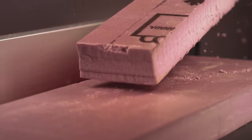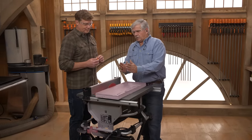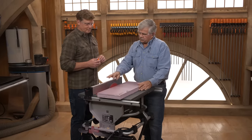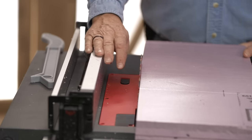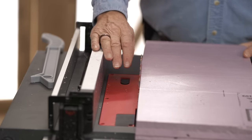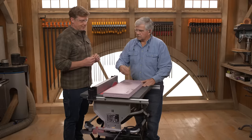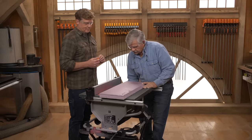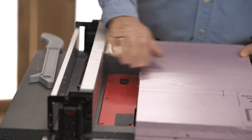I have two things against me — I don't have a riving knife. The riving knife would help against this; it would help against the pinching of the board as it goes through. Also, the blade being so high — if I was to cut through here and this grabbed my hand at the takeoff point, I would probably lose my fingers. If I put the blade down where it should go, where the teeth just come through the top of the surface, and I did get kickback, I would have less chance of losing a finger.